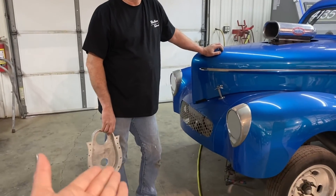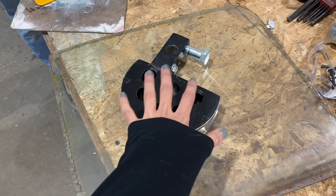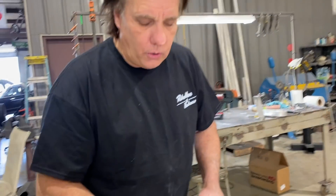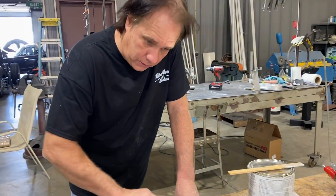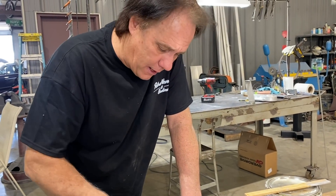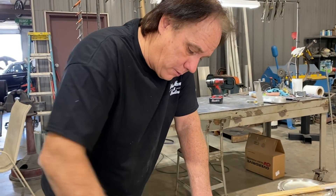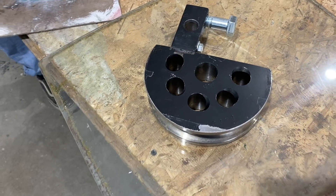Basically breaking out the sand casting and the aluminum that we're going to be melting was probably last melted about 15 years ago when I made those. So rather than making an actual mold and taking the time to do that, he's just going to use one of his dies that he already has. I'm going to fill those holes up so I can pack sand around it. Once I'm finished with this, I'll drill those holes back out and turn it back into a die. For the time being I could put tape over it, but the sand will push the tape in and make indentions, and when I pull it up out of the sand it'll tear the sides of the sand mold. So I'm just going to temporarily fill those holes with Bondo.